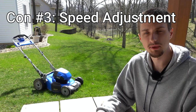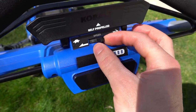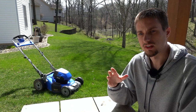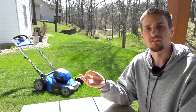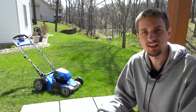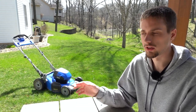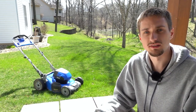Going along with that, the speed adjustments on the handlebars are very cheap — some of the cheapest parts of the mower. It feels chintzy when you change it and I've experienced some intermittency with the toggle itself. I typically use the mower at about three out of five in terms of speed, but at four out of five the mower moves too fast, and five out of five is essentially running speed. One out of five is way too slow and five out of five impacts cut quality because you're moving so fast over the grass. I'd like to see more consistency and range in those speed adjustments.